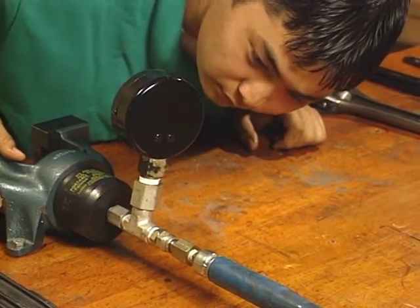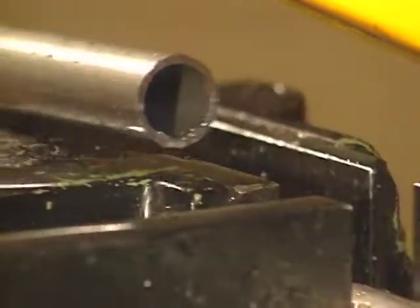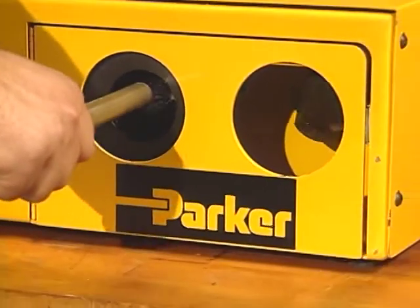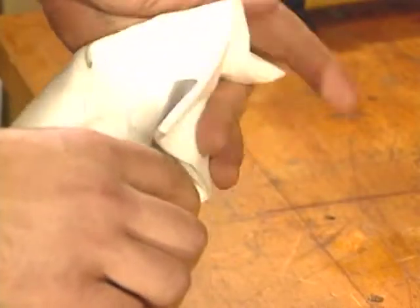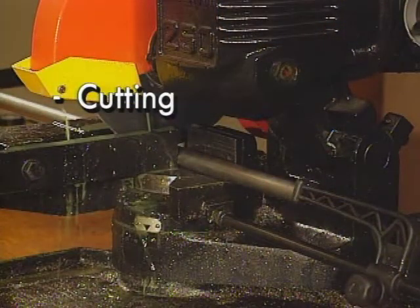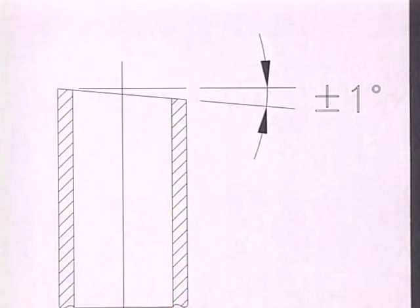Check for oil leaks. The next step is proper tube-end preparation. Tube-end preparation is one of the most important steps for ensuring an optimum leak-free seal for any brazed, flanged, flared, or pre-set connection. No matter what the tube material, there are three key preparation guidelines: cutting, deburring, and cleaning.